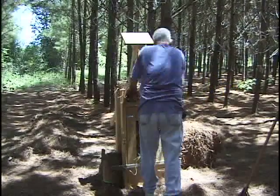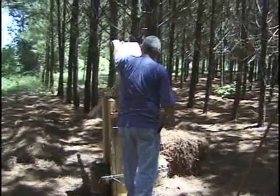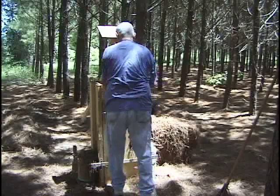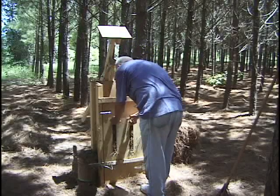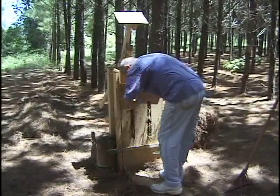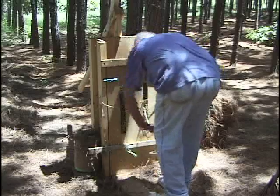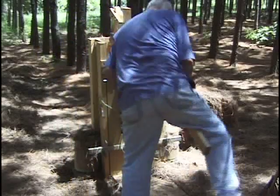That'll be enough for this bale. Pack this down, pull the sticks out, bring the plunger over, pull it down, pull it back out. Take the strings, give them a pull, pull them off the back, put them through the slots. Take the string at the bottom, tighten up on it, pull it down, tighten up, pull down. Same thing on this side. Now it's ready to put the press on it to get the bale tight where it'll stay in the bale.